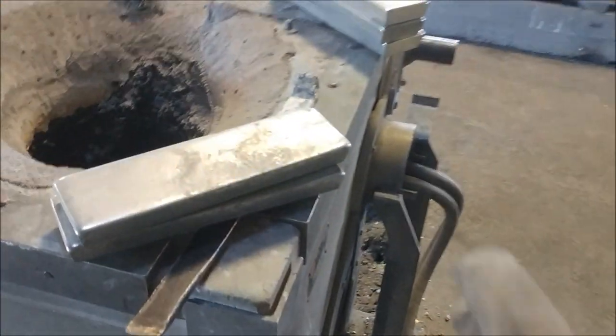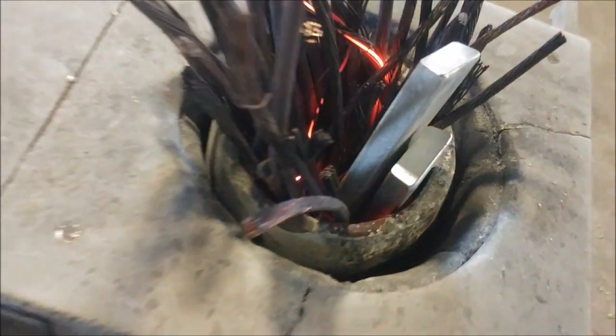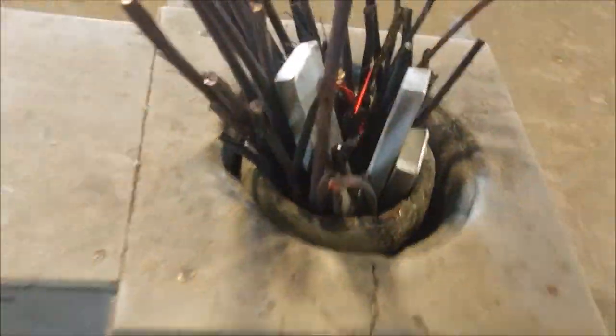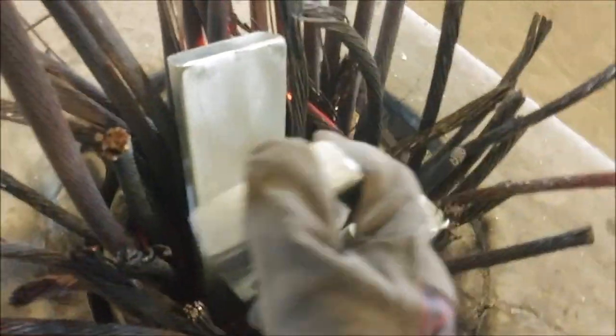Our goal is to get about a 60-40 ratio of copper to zinc and make some nice yellow brass. We're doing it a little bit differently than is typically done. The industry standard is you melt down your copper to liquid and then add in your zinc, but by doing so, the copper has such a high melting point and the zinc has such a low boiling point that you end up boiling off a large component of your zinc — about 10 to 15 percent — as zinc oxide. I've found that you can actually melt the zinc down into a puddle and the copper will dissolve in that zinc to form brass without burning off all your zinc.